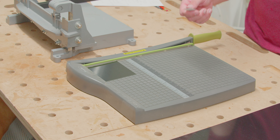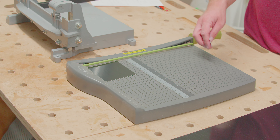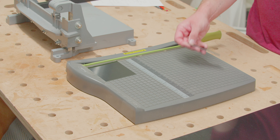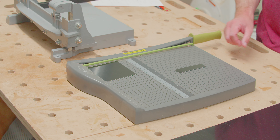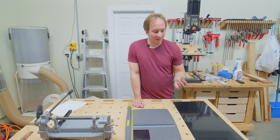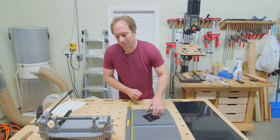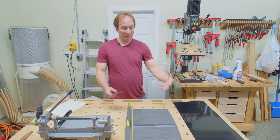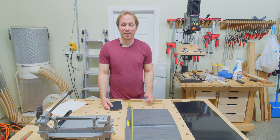The other option is just to bend that corner back into shape — you can literally just do it on the bed of the cutter. Personally, I hate doing this. Even when you get it mostly perfect, there's like a little bit of a ripple. It's just not quite perfect. If you're not a perfectionist, that's honestly fine. So that's the paper cutter option. You can buy these for like 20 or 30 bucks, and if you're lucky you can find one of the old big heavy wooden ones in a thrift shop or garage sale.